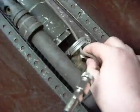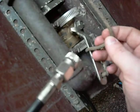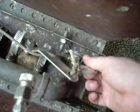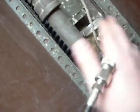This valve setup was a little tricky. Originally, we had this wire running under this piece of all thread, so I had to change that because it wouldn't slide very easy. So I found an old pulley at my grandpa's house, and I put that on here. This also acts as a stop, so when this comes down, it stops this from opening completely. It stops about 1/8 of an inch from being fully open, but that's fine.